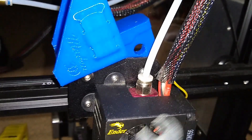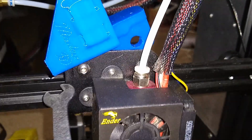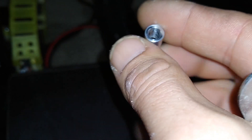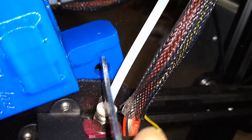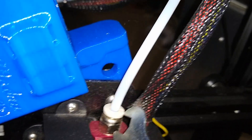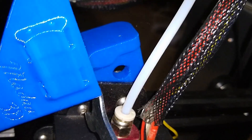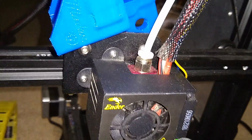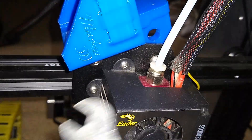The next step is to remove these and place the extruder on the carriage. It is possible to do this one at a time — I started with the left, laced it through. The mount we're using is going to replace the spacer. Now I'll remove the right side, slide it down into where the spacer is, remove the spacer, and re-bolt it. That way we don't have to remove the whole carriage.